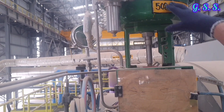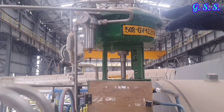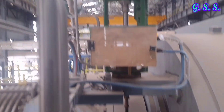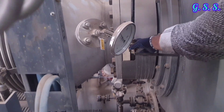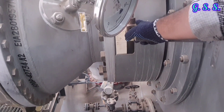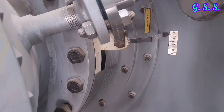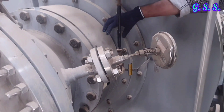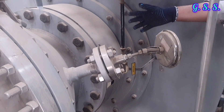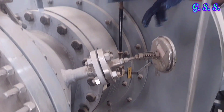This is the control valve actuator. When more instrument air pressure is applied, the disc of the control valve pushes the rod down, the lever comes down, and the IGV rotates in one direction. When the lever goes up, the IGV rotates in the opposite direction. In this way, the inlet guide vane (IGV) rotates and allows more or less airflow through the compressor by changing the vane angle.